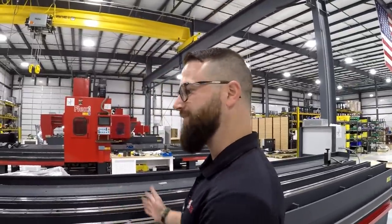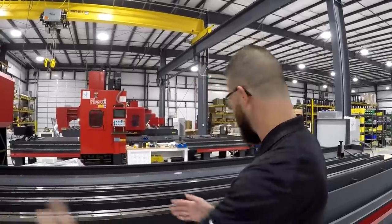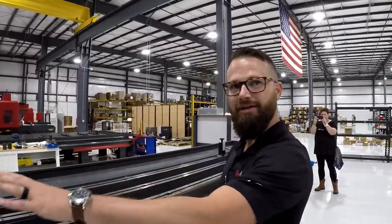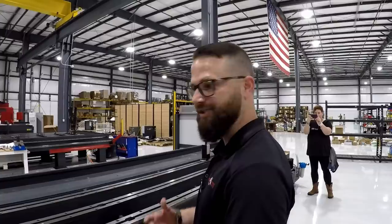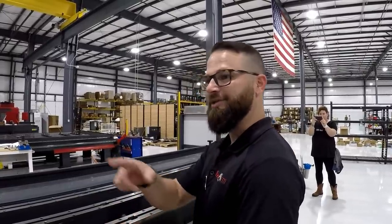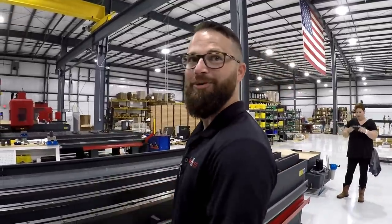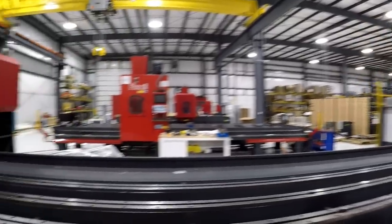Okay. So the main goal on this machine is 100% spindle uptime. If you're setting up stations, say two stations on this machine, station one goes 10 feet, station two goes 10 feet. While the spindle's down here turning and operating on this machine, I've got a guy down here setting up fixtures, doing setups, removing parts off, and as soon as he spins back around, we call that pendulum mode, and he just bounces side to side like a ping pong ball, and that spindle keeps turning. That is cool.